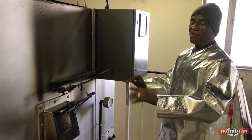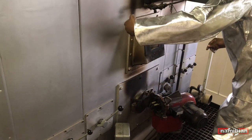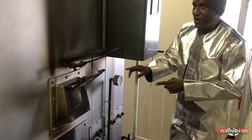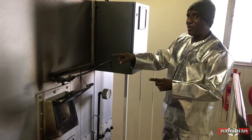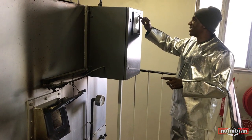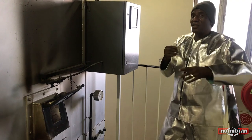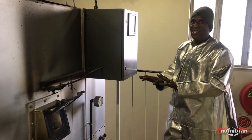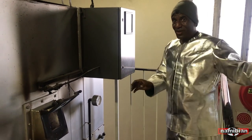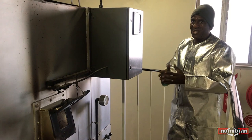If it's not necessary, I will take down the wind. But it must be done two by two. If I put one side, the wind is coming in from that side. This is the window where I monitor the body — I can see the body. It depends on how hot the machine is and the temperature inside. I must be careful. I cannot just open up and close because I must monitor things here. If it's more than zero degrees here, it's positive — it means if I open up here, the flames can come out. I must monitor. I must be careful and remain here, not in the office, or I will make a mistake. I must be relaxed, I must be cool, and then I operate the machine.